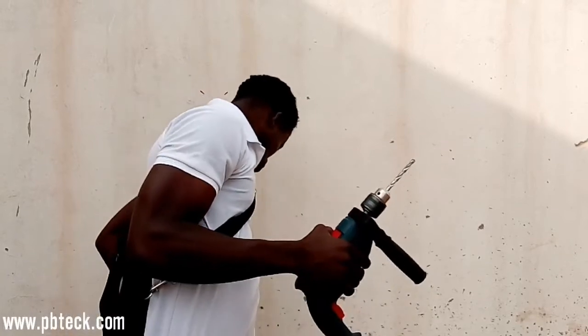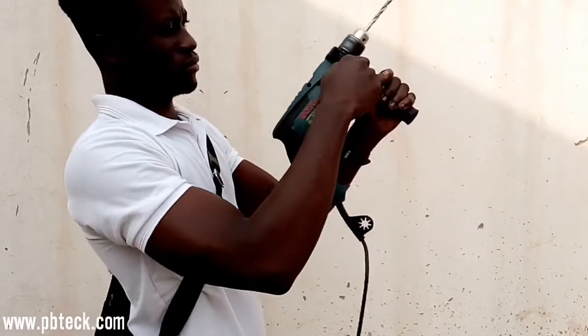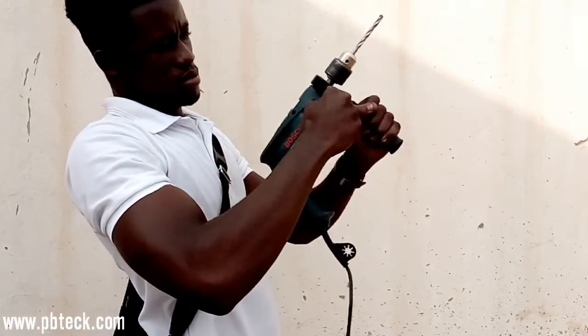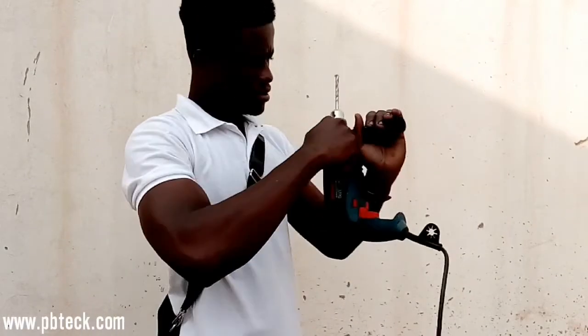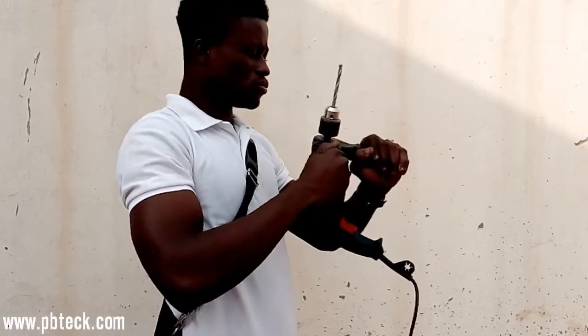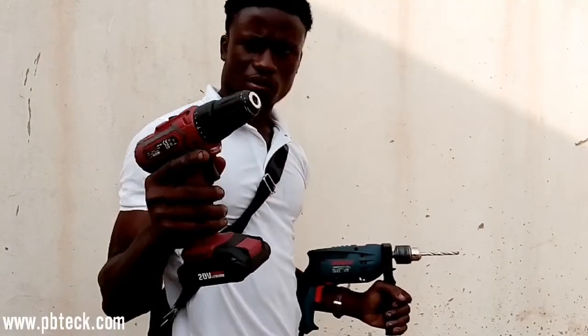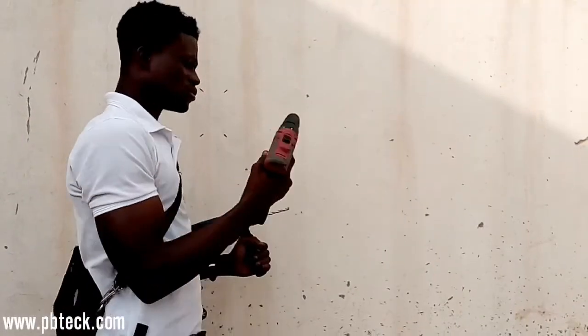Okay, now is the time for you to drill your holes. You can use any other drill machine in case the concrete that you are going to drill is not too hard. This is a hand drill, you can use this hand drill in case the surface is not too hard.